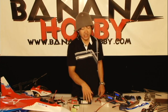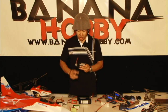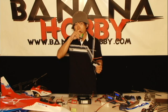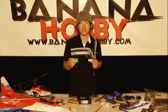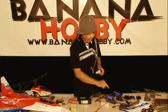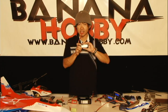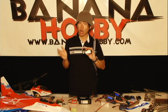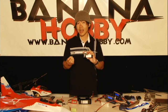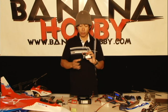You don't always have to use these LiPo sacks — I just suggest them as a precautionary measure. If you keep an eye on it, that is fine. A lot of guys are charging their LiPo batteries and going to bed or going out to dinner — don't do that. This is for people just entering the hobby. Do not charge these things and go to bed. These things don't take eight hours to charge. If you have a LiPo battery charger, chances are it's a peak-detecting charger, which means once it reaches maximum capacity it will shut the charge cycle off. But electronics may malfunction and keep charging, which could become a hazard. That's why I say keep an eye on it. Don't charge it and go to sleep and wake up eight hours later.